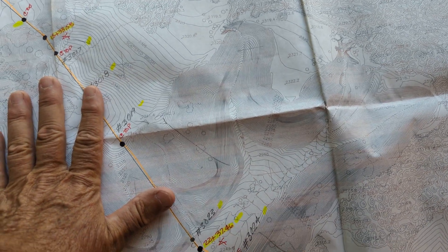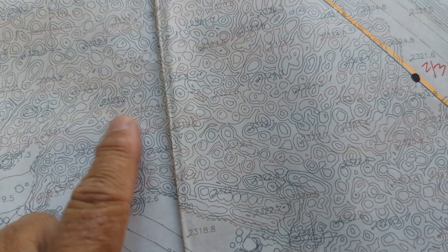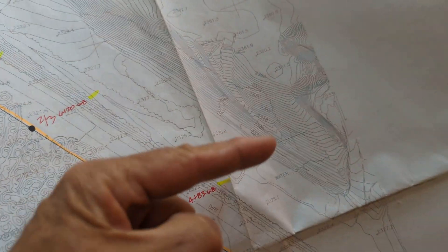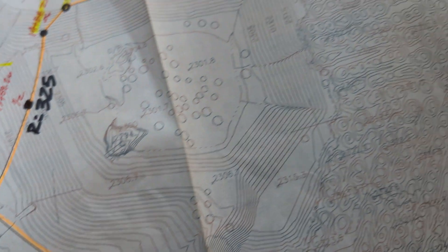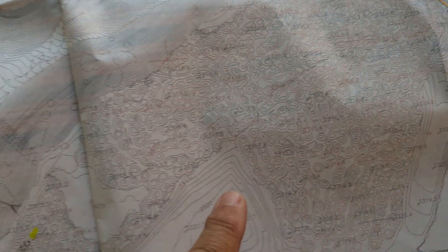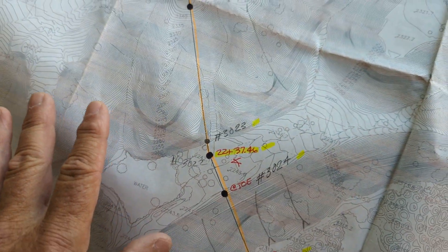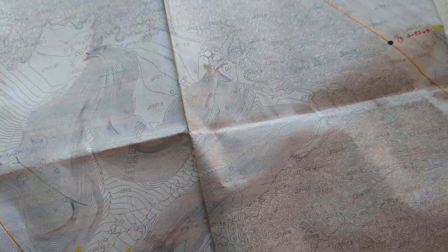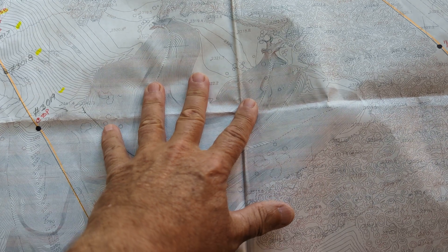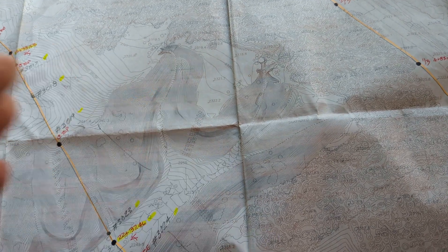So we were given this contour map. This is a recent aerial. All these little areas here are all spoil piles - there's a big housing track over on this side, so they are bringing over and dumping dirt over here, so those are all spoil piles. There's a man-made basin here, and again more spoil piles, and this is more natural ground right here. When you're given a contour map in construction, it covers the area that you're going to be working in.